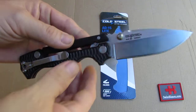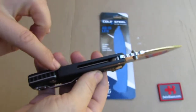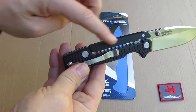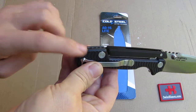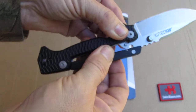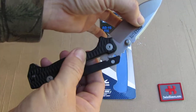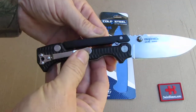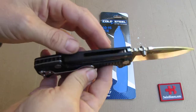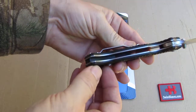What is mainly interesting is the lock bar design. We have the top part here in aluminium with the steel locking part that goes into the blade. The aluminium goes together with the spacer and then it is hinged here with a spring, so the thing basically lifts up and down. We have the big slot with the metal pin there where it locks — nothing too hidden. It is easy to clean, and the aluminium part is strong enough with the spring hidden inside, so there is no way that dirt can get in.